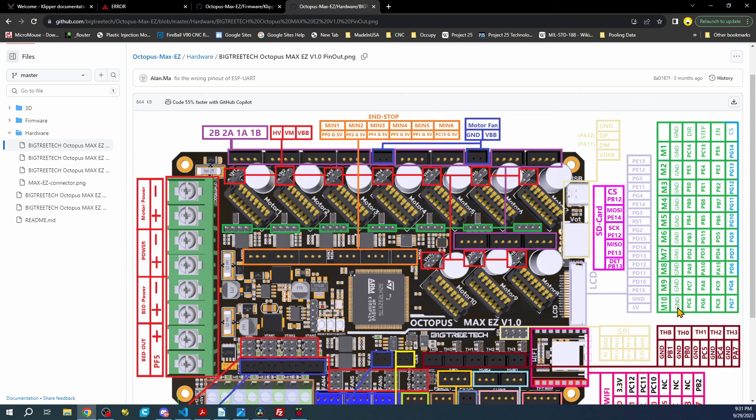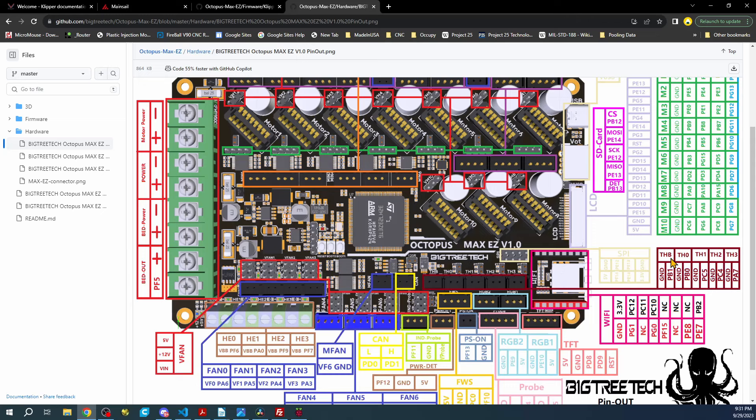You can see there's a ground pin, PC6, PG6, PC8, and PG7. CS stands for chip select, EN stands for enable, Step is your step, and Dir is direction. You're also going to need to know where your thermistors are because it won't function initially unless the thermistors are correct. THB is thermal heat bed, and TH0 is thermal hot end zero — there are three more after that, and counting begins at zero.